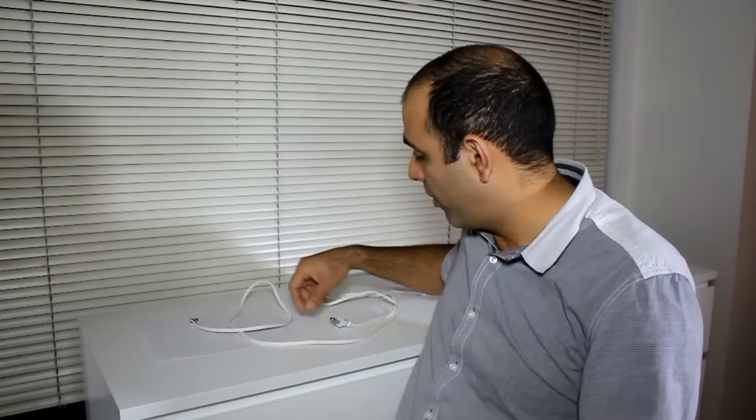I made this simple circuit and I'll plug it in. Now the circuit is hot and the voltage is on the circuit. Something you must never forget is that some capacitors, like electrolytic ones, are polarized and you must never connect them backwards or they will blow up. Now I have replaced the capacitor on my circuit and I'll plug it in.